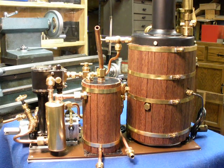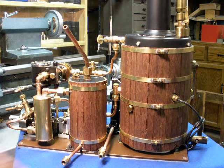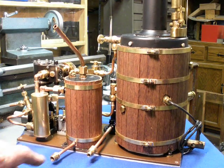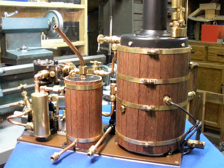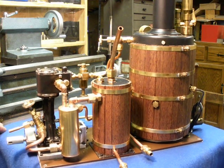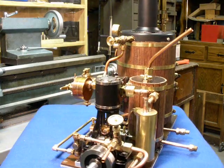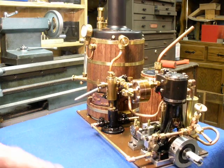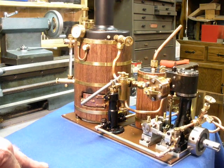Had to make some changes this morning to make provision for the feed pump mounted on this base plate. You can see right here is the inlet to the hand pump. Right here is the overflow from the sludge tank to let that drain. Same configuration on the heater. Really the change was the drain on the sludge tank and replumbing the inlet and outlet of the hand pump.